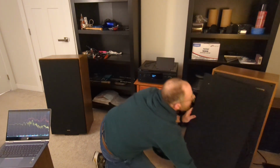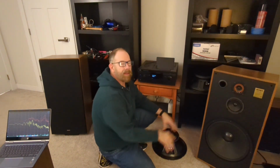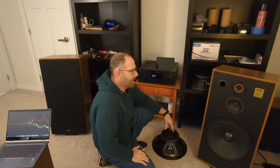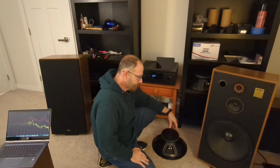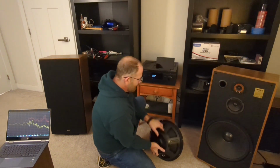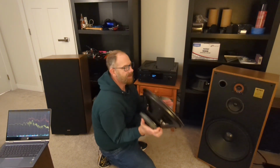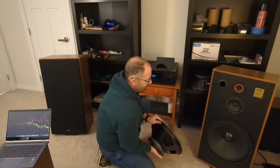And the reason I did that at the time was because, honestly, I thought they sounded a little bit better than these woofers did. And they actually measured a little bit better as well. So I felt that these were lacking in the mid-bass portion of the frequency band. I ran some really rough frequency tests, very rudimentary, using just free software, a Chromebook, the built-in mic on the notebook, just so I can try to gauge what these speakers are doing.